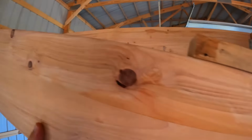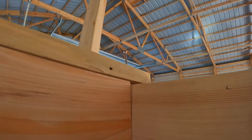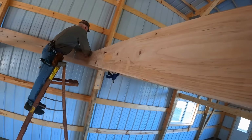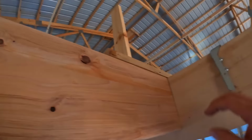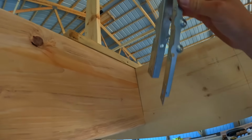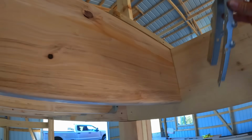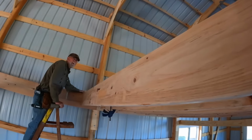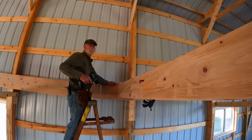All right, so we're hanging the floor joist right now. So you can see our little hanger strip on top is what holds it. We've got our line marked out where we want the joist to end up. Senior's got his hung down on the other side. So basically we're doing this backwards. We're not hanging the hanger first and then sliding the floor joist into it. We're hanging the floor joist, and then once we're happy with its position, we'll go and attach the hanger. That sounds about correct, right? Yep, then I got a screw on the top. We can hold our tops in position.